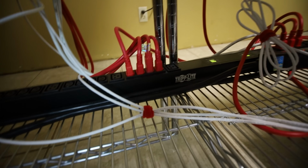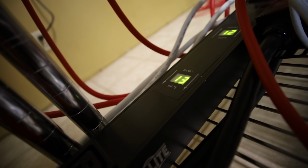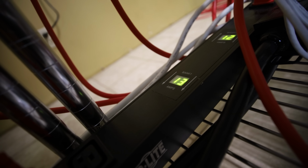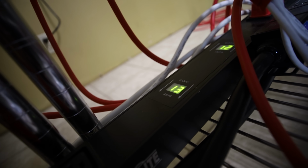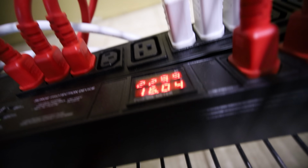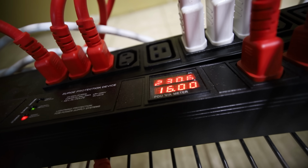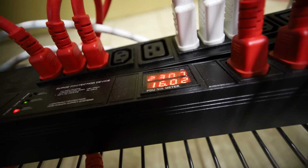Okay, the 3060 Ti rig is on, and we are mining and now using 13 amps. So we went from 9 to 13, so that 3060 Ti takes roughly about 4 amps, over 800 watts or so. So we are now at max capacity at the 80% rule on this 240 volt 30 amp PDU. That is good. I am glad. We hit it perfect. And on the other PDU, it looks like we got up a little bit more, 16 amps now, roughly. So I can add another 8 amps, roughly, so that we can get the 24 amp utilization on the 30 amp PDU.